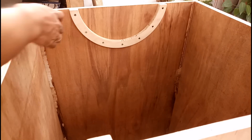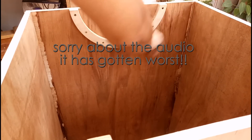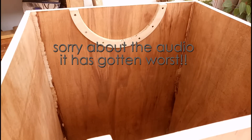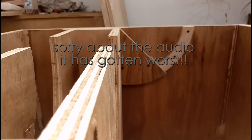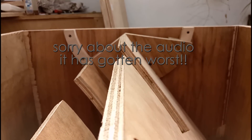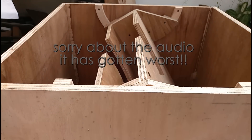Welcome guys. Here we are on part 3 of a 4-video series. I assembled the cabinet the night before and attached the lower trunnions — I made my first mistake with wrong-side butt joints but managed to fix it anyway. I attached trunnion items 19 and 17 on the carriage housing, both front and rear, and placed it on the lower trunnions attached on the cabinet panel.